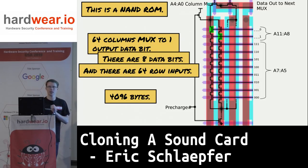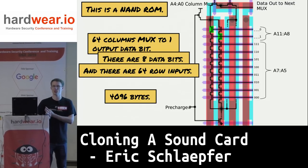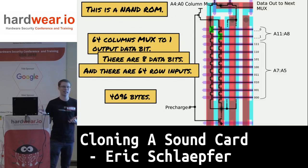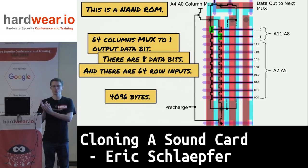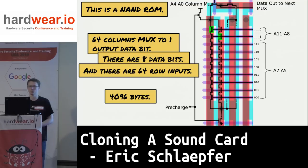This ROM is an implant ROM — each transistor in the branch has two possible configurations. One is a working transistor; the other is a transistor that is stuck on. They use an ion implantation machine to take charge carriers and embed them underneath the transistor, which shifts the threshold voltage so there's no way to turn it off without a negative voltage. Each row input is always a 1. If you want to read a particular row, you bring it low — if the transistor is implanted, it stays on; if not, it turns off. That's how you encode a 1 or a 0. And unfortunately, I cannot inspect that implant layer with an optical microscope.